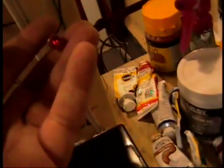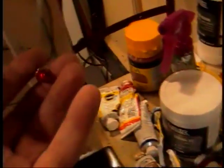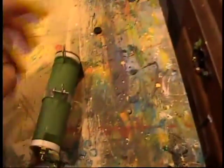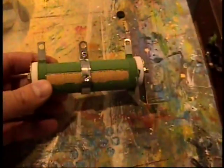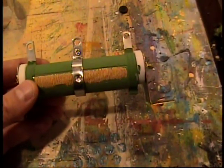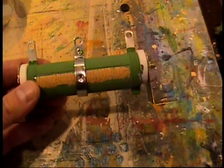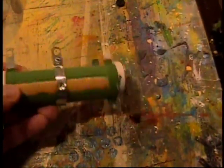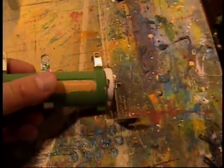That's one step. My little neon light — you probably can't see it on the camera — but it's blinking away. Also, to tune the resistance on the base of my transistor, I bought this device which is basically a rheostat. Instead of a potentiometer, it's basically the same thing except this one is in a linear format instead of a rotary. So basically it's just a bunch of stacked resistors.